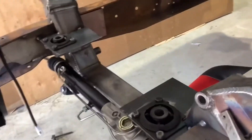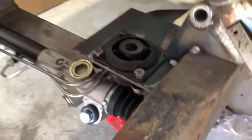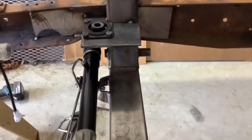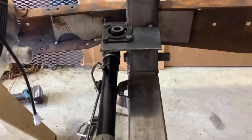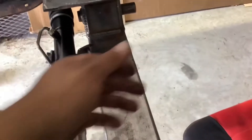Everything is so close — the bottom of those motor mounts to that rack and pinion. This is just tacked. Obviously this gets bracing yet; those flat plates are just put in there, nothing is fully welded. We're going to brace off of that plate — brace down from here down to here and the same way off of this end.